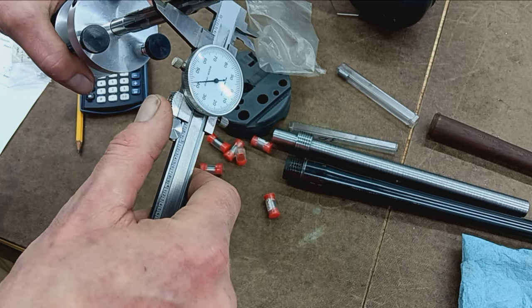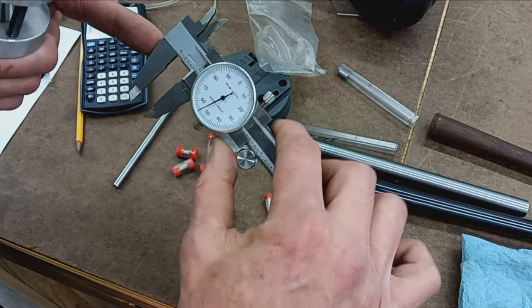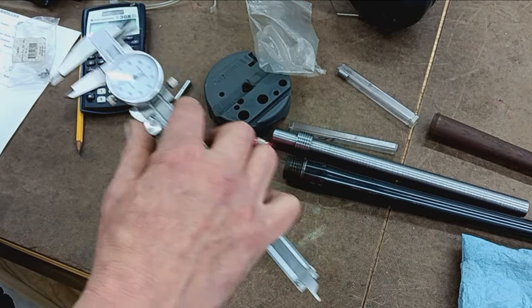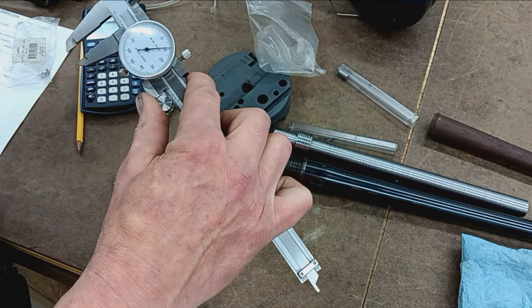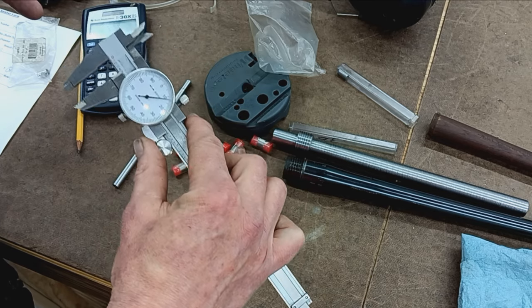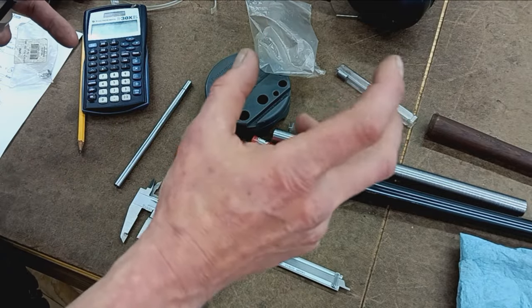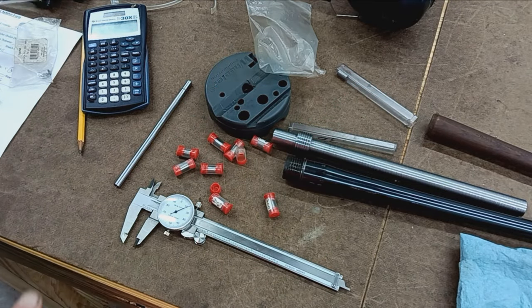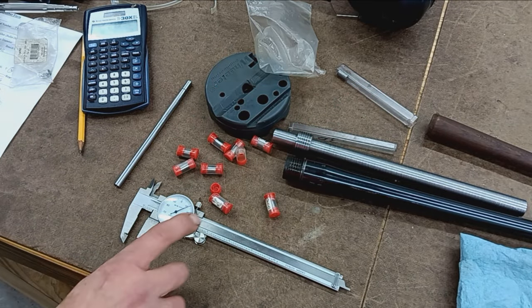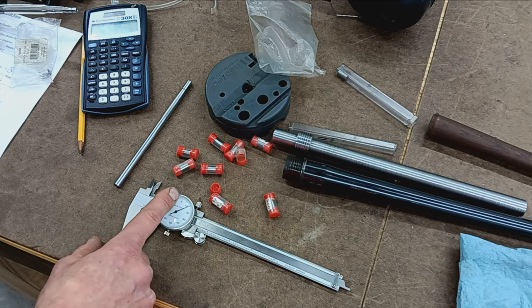And I just kind of close them up and then rotate to see the highest point, 454, 455. So something like 410, somewhere in there will be the drill that I'm going to use. And then we'll true the pre-drilled chamber with the boring bar. So I'm going to select a drill that's somewhere in this 400 range and pre-drill the chamber